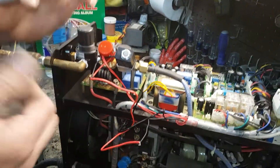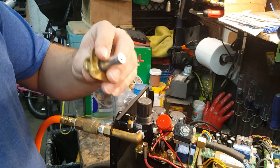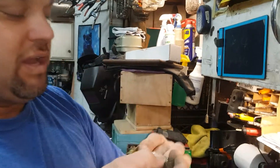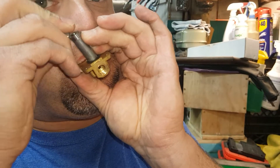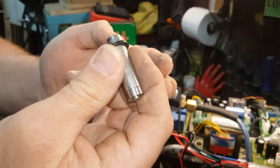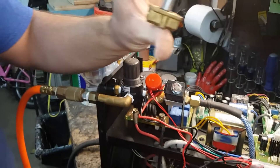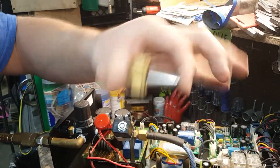The way it works - bear with the crudeness of this - I'm going to put air in here with my mouth and put a magnet to it, simulating the electric magnet. What happens is the plunger just pulls up and allows air to flow through there. So I knew that this valve was bad because it was all clogged. I got that cleaned up and was all better - but I still couldn't get this to work.